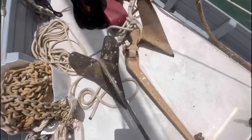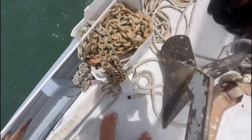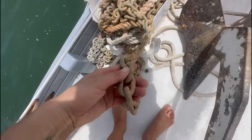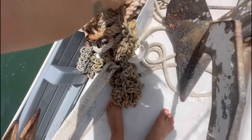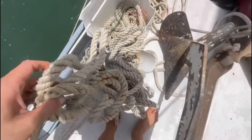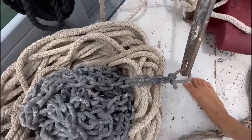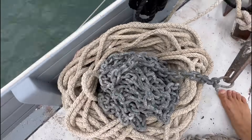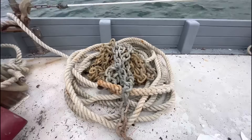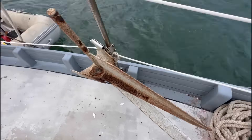She's got a CQR over there as well, but I've never really used one before. The chain — I measured it — it's about 20 feet, which is a little too short in my opinion. I'm going to use this as a backup. She had 60 feet of three-strand. The delta is set up. I coiled up my braided rode and my chain, and it's going through the side of the boat the right way. And that's the setup for the Danforth style with the three-strand.